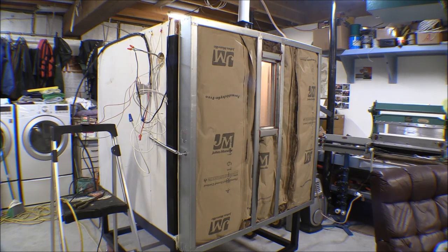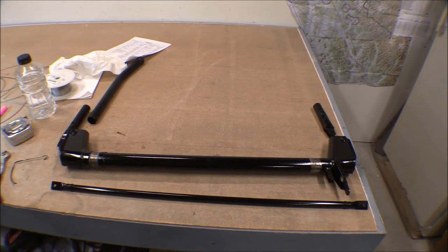It's been almost six hours now. The temperatures on the sides are all around 80-90 degrees, a little hotter on the corners at about 110-115 degrees, about 90 degrees on the ceiling, and the plywood roof on the outside is about 95 degrees - I probably should have put a piece of sheetrock first and then the plywood. The temperature inside varies a little bit, so this would probably benefit from having a fan to circulate the air and keep it even.